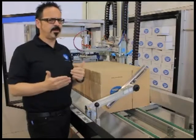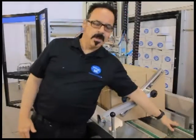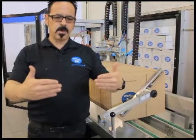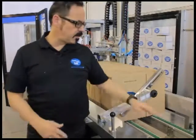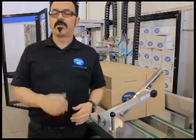There's no need for any secondary manipulation. The machine also features a dual belt drive system that allows us to independently control each belt, so as the case travels through, they travel through without any kind of skewing. We can compensate should one side get ahead of the other, so that when we get to the forming section of the machine, we eliminate the potential for a case jam.